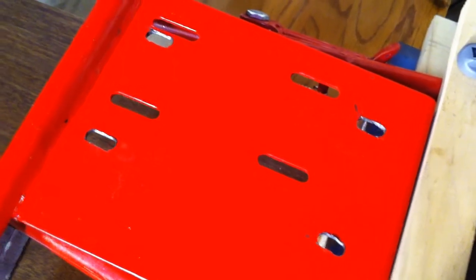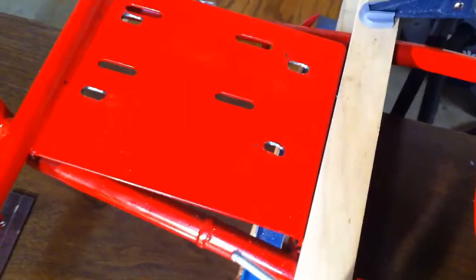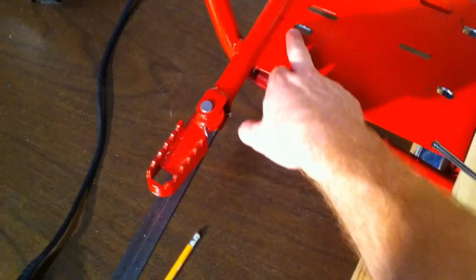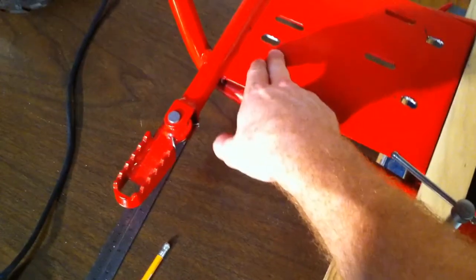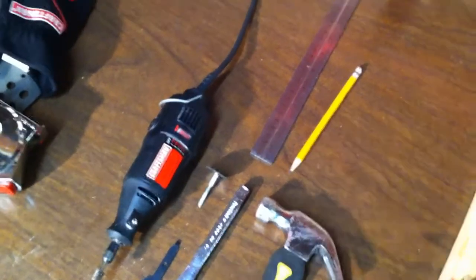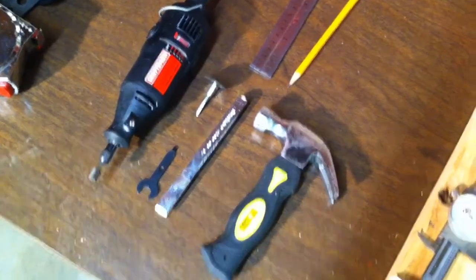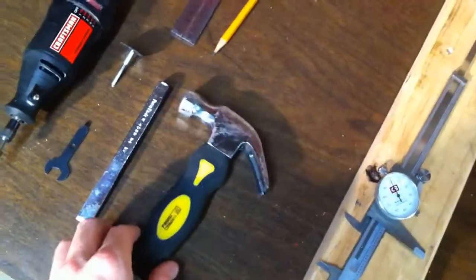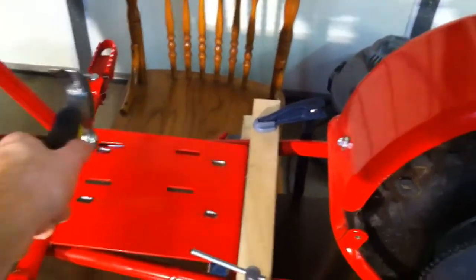There are only two holes connected by straight cuts and then a little bit of rounding and sideways cutting. I used a ruler and a pencil to draw a straight line from the middle of one circle to the middle of the other, so I knew what to cut along. Once I cut with my fiber cutting disc along that line, down as far as I could without cutting into the edges of the metal on either side, I stopped and then punched out that center piece with a nice strong chisel and my little stubby hammer. That gave me some room in there — as you can see, it's not a lot of room up top, but it allowed me to get a nice good whack down onto the chisel.